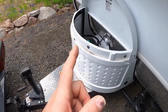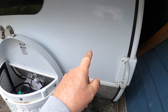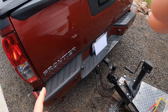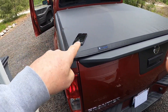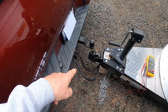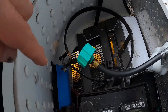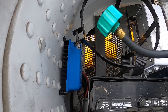In phase one, I put in a new converter in the trailer so it knows how to charge the lithium battery. In phase two, I put in heavier cables back from my alternator back here to my truck connector where the trailer hooks up to. And in stage three, I put in this Victron DC to DC charge controller.